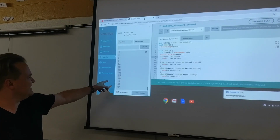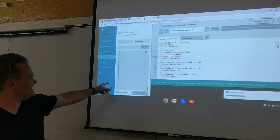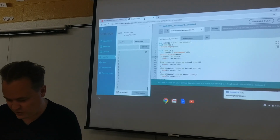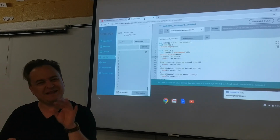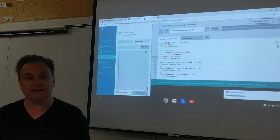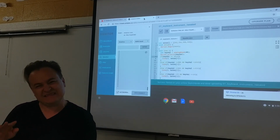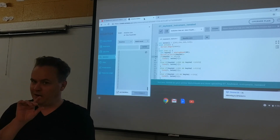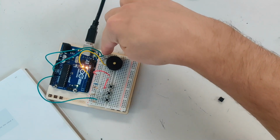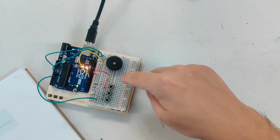And you can see here, 1016, 976, 1015, 1011. As I do it, it's not quite 1023. So somewhere in all of these wires, there's maybe a little bit of a weak signal. So it's not giving a full 1023. It's like 1016, 1017, very close to 1023. But there is a problem either in my power wire or something else connecting here.